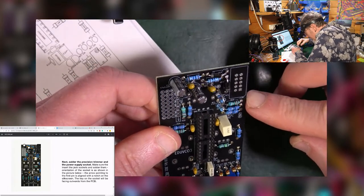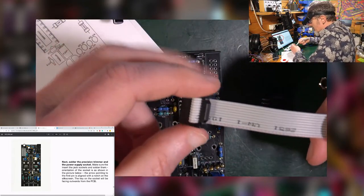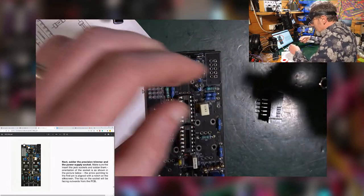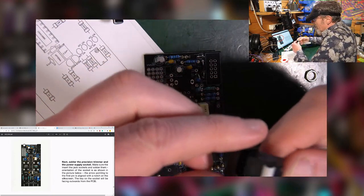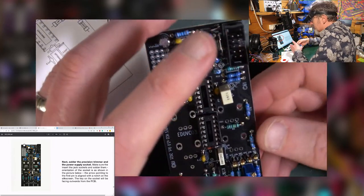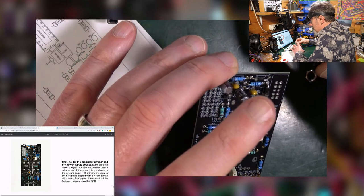Now it says down here, minus 12 volts, which will lead me to believe, see, I could kind of confirm this, that the minus 12 should be the red stripe on my ribbon cable. Do you see that? Oh, it's a very faint red stripe here. But this will plug in like that. And if the red stripe goes to minus 12, which is on there, then this has to go this way around, because this has a key on it here and can only fit in one way around. Therefore, by that process, it must go in this way around in order for that to function correctly. The arrow pointing at the first pin. Is there an arrow? Oh, I don't see an arrow.